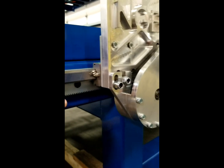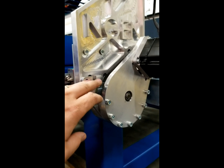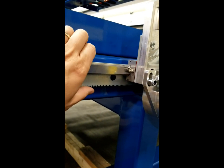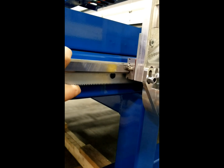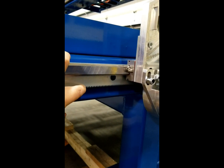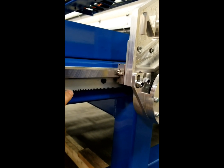The alternative would be to simply slap on a piece of gear rack or weld it on, and use a spring tensioner to spring-load the pinion in, or use an air cylinder of some type. The problem is, if we put too much pounds of pressure on the pinion, the pinion is going to wear fast. And also, even though it's a quick method of building a machine, it certainly doesn't offer the accuracy that this kind of system offers.